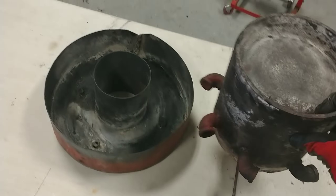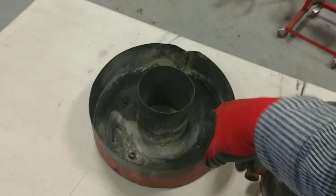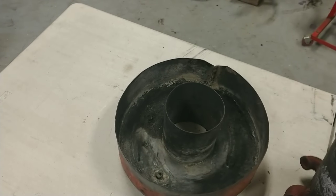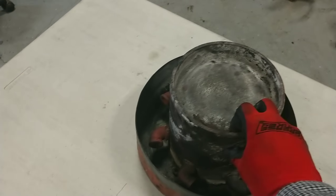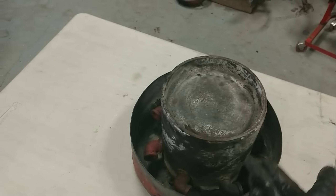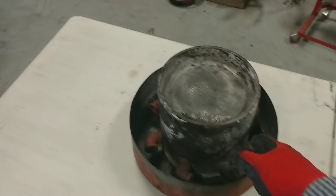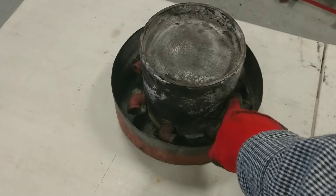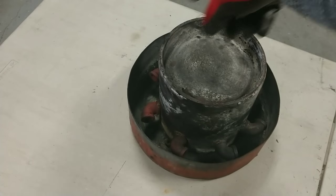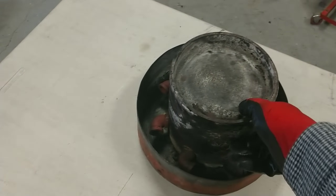As I've explained in the other videos, this is our oil reservoir or burn chamber, this is our air intake tube, and then we place our hat on top of the air intake tube. The air comes up through the intake tube, hits the top, goes back down the sides of the hat, and is forced out through these 90-degree fittings to create a swirling motion inside the burn chamber.